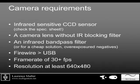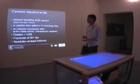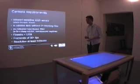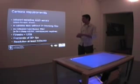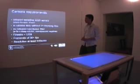First I want to continue on what hardware we need to create a multi-touch table. For the camera, you could use a simple webcam, but consumer cameras often contain an infrared blocking filter. If you're going to use a normal USB camera, try to check if you can dismount the lens and hopefully buy a separate one, or just scratch off the infrared layer.